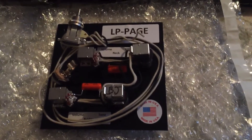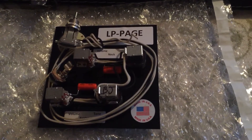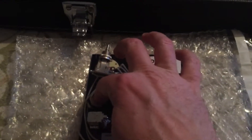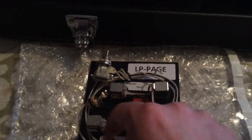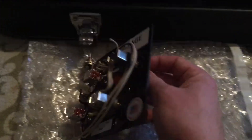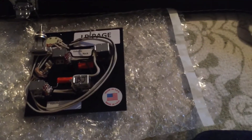The main item going in is an American-made wiring harness — I can't remember the company name but I know it's 920D Custom wiring. It uses Bourns pots, a Switchcraft switch, and a Switchcraft jack. It's four push-pulls, so you've got your coil splits and Jimmy Page-style out-of-phase options. Really nice pots, really smooth action.